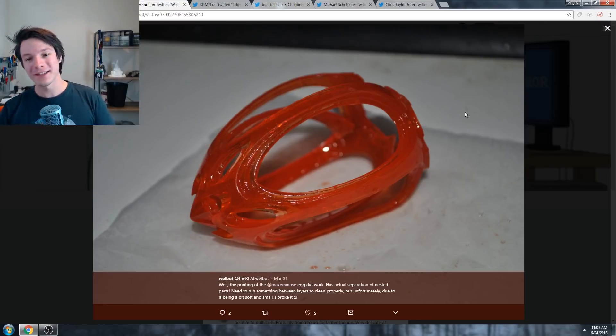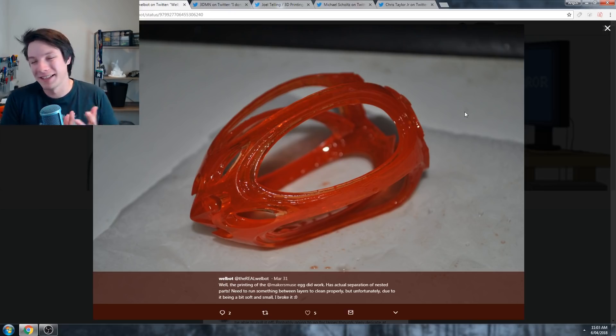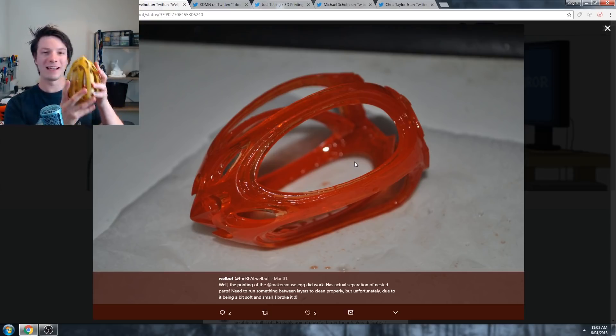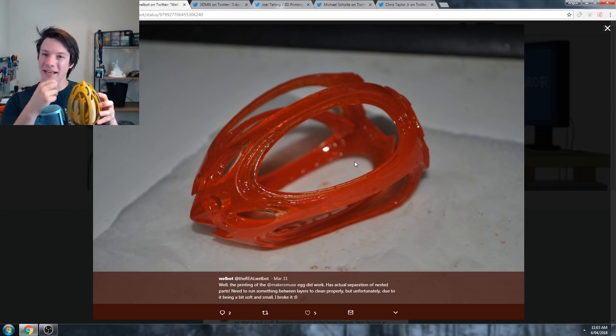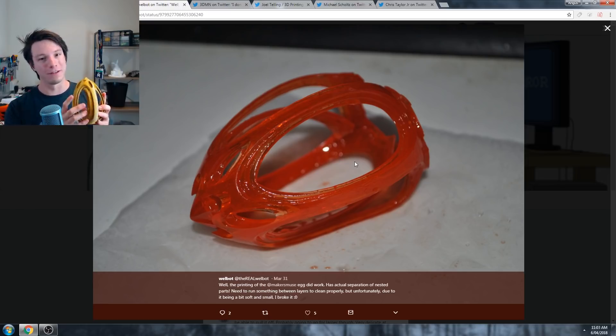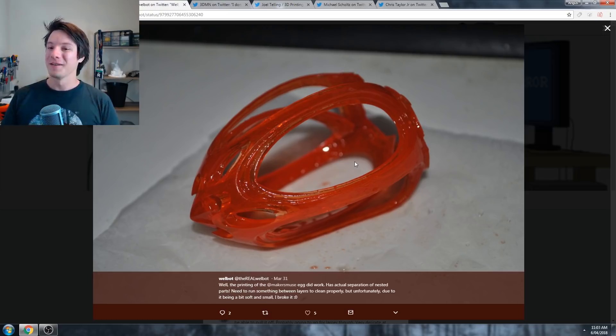Resins need post-curing, and that's always been the issue with parts in liquid resin, because when they cure they tend to stick to each other. He said it did move independently initially, but because it's so soft coming off the machine it needs to be post-cured, and it did break, unfortunately. But that is some incredible detail - super impressive. It's almost worth designing a file just for an SLA version of this, where the parts are separated already with maybe tiny little internal supports that just keep them apart while you clean and cure it, then you break them free. I will be playing with more resin printers in future, but it's definitely a challenge to do anything like this in resin. Well done - that's pretty brave and impressive.